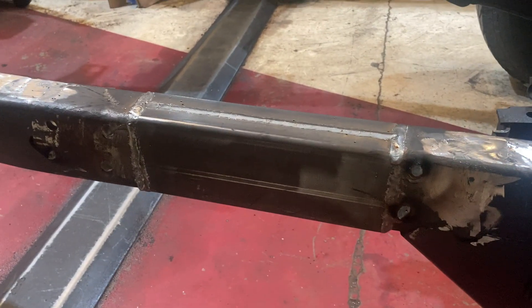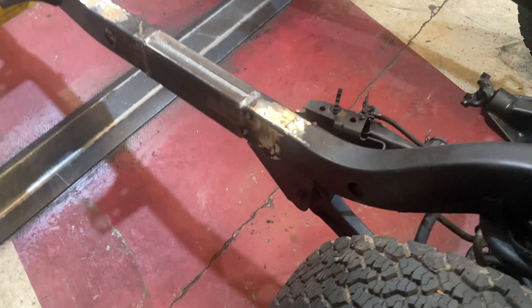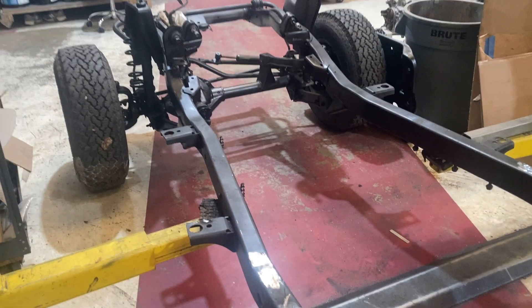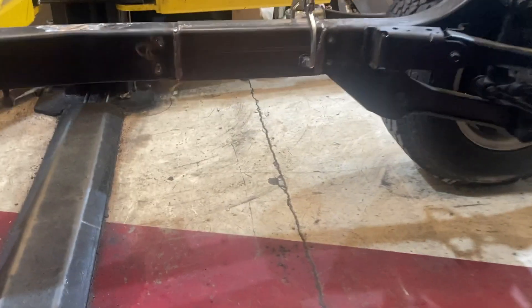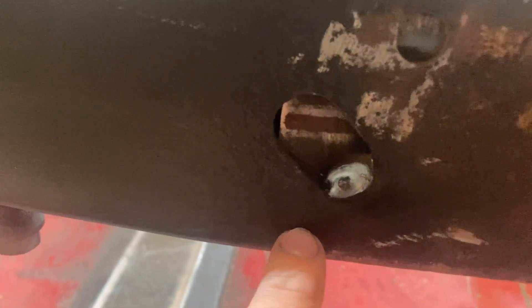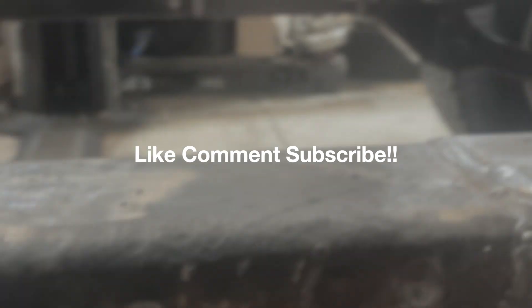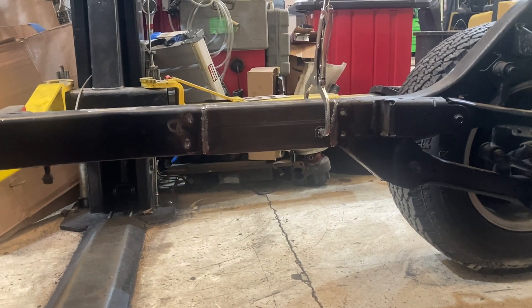That's the final result — on both sides it is completely welded up and plug welded on the insides. We're really happy with how this turned out. This is how we lengthened our Jeep frame to meet the Willys chassis wheelbase, so we can have modern suspension and all the modern amenities of the Jeep underneath the classic Willys Wagon. If you have questions, leave a comment below. Like, comment, and subscribe — we have a lot more videos on this Willys Wagon coming every Friday. Thanks for watching!